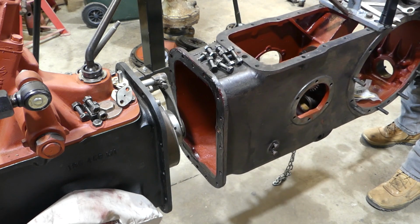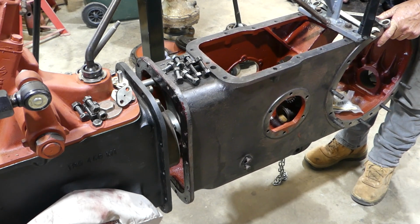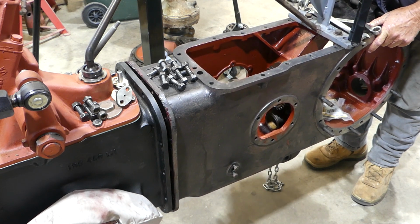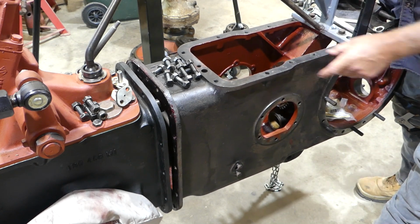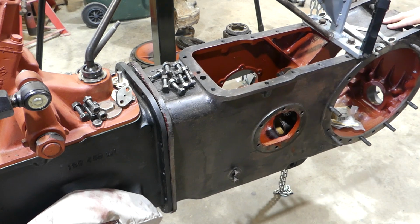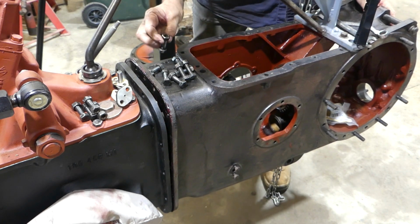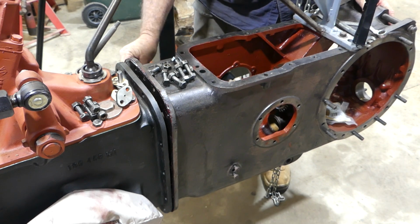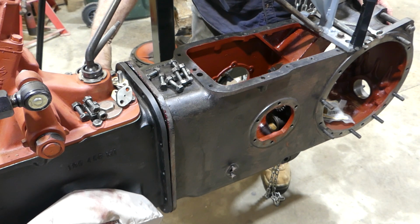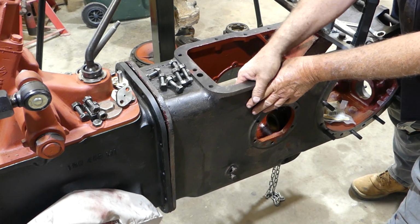Now, I've got the gearbox housing swinging on the gantry with our little bracket here. So look, all I really have to do, there's no shafts to line up or anything like that at this stage. I've just got to pop him in there, perhaps let him down just a little. And I can bring the gantry around to hold pressure on it. So that'll hold a bit of inward pressure on the box. And I can pop a bolt through at the top here on this side and just do it up a couple of threads. We're just looking to line the whole show up at the moment. And the same around here where you can see. So it actually needs to swing a little like that.